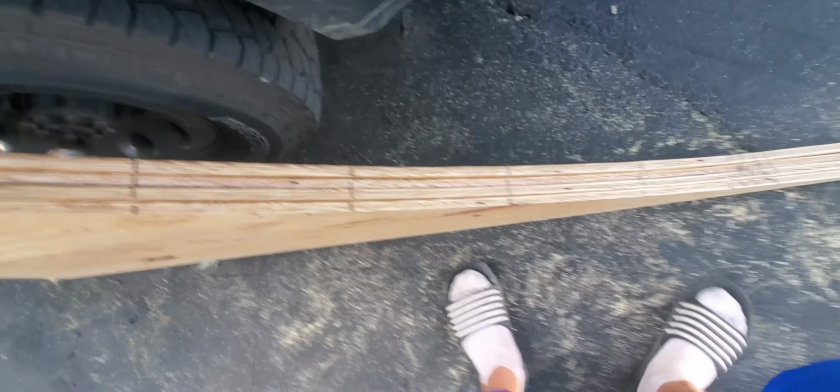So I'm going to show you guys my trick as to how I'm hanging these boards in between here by myself. Okay. Take your screws, go on one side because you got your marks on top of your board where all your screws are supposed to go, because we marked those at the beginning. Take your screws and pre-start them. Bring them out the back. See how the tips are sticking out? Those are going to act as little partners. Those are little buddies helping me out along the way, okay? On the other side of the ramp, you do the opposite. You don't let them hang out. You keep them inside the board. I'm going to show you what I do.